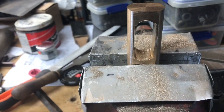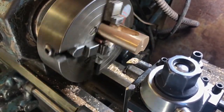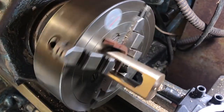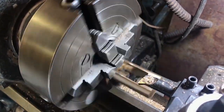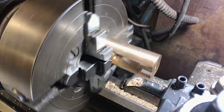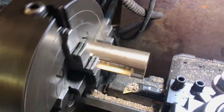Finally I want to make a curved surface on the inside edge so it'll fit on top of another circular object — so it needs a circular curve cut on the side. It's a little tricky to work out exactly what radius the curve should be and then position the work in the chuck securely enough so it doesn't get knocked out by the tool. But I finally got it set up and achieved a nice neat curve on the inside surface.